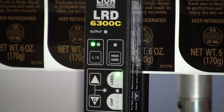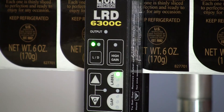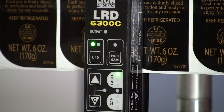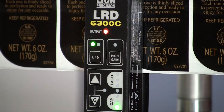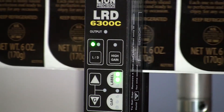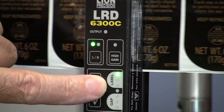So what we have to do instead is stop the web so that it is centered on a gap. There's a little groove on the top of the sensor to help you align that. Then we set it at an actual gap instead of a missing label spot, and it begins to work — but you can see sometimes it's missing them because the light bar still isn't going down far enough, so you have to check that.